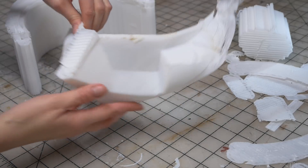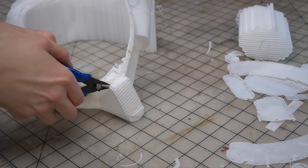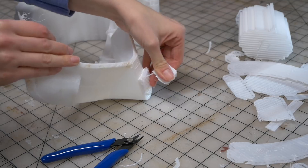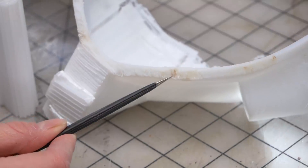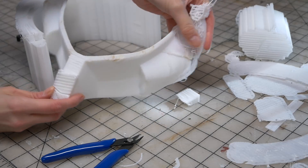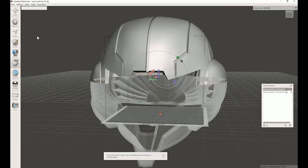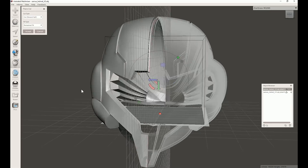This is my first time working with high-impact polystyrene filament and it seems really sturdy. I thought I successfully removed the support under the helmet's chin, but then I realized the support tore away and left the top layer attached to the model — it looked like it was melted to the surface. Some areas of the white filament also looked burned. I was afraid to try another almost five-day print, so I decided to break up the helmet into four parts to test a smaller print and see if it had layer-skipping issues.